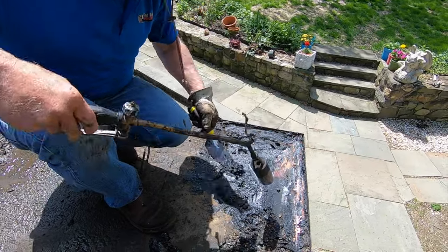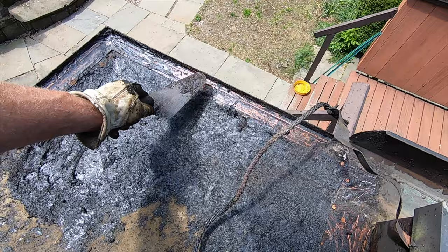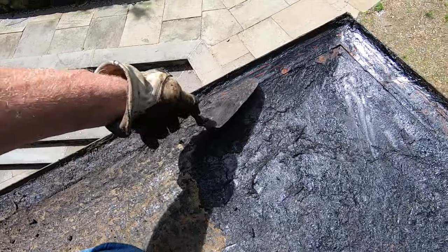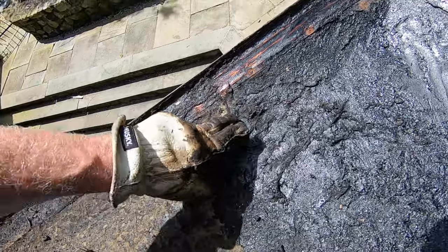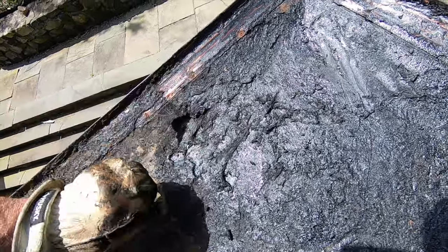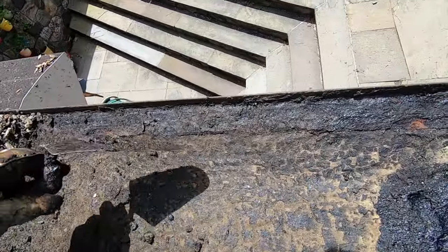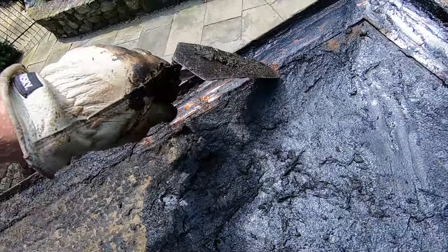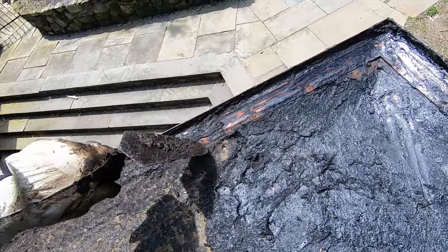So that's fairly clean now. On this gravel roof where it's leaking, I've cleaned this area. I've removed all the tar that people put on top. And also the transition that the previous roofer made from the built-up roof to the copper flashing — they used this type of cotton-saturated material, and that's what they normally use. They make the transition with that cotton stuff. It's like a cotton base. I don't like that stuff, and you can see it cracked. Everywhere is a crack here, and that's where it's leaking. But not only the crack — the nails corroded away. See the nail? No more nail there. All the nails corroded away because of the leakage and water sitting there. You see the rust there?